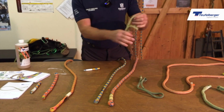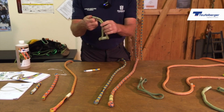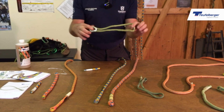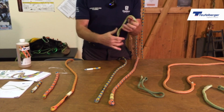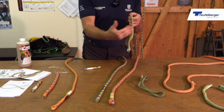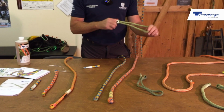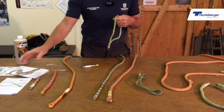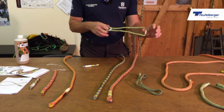We've got another rope here, this is an Ocean Dyneema, and again, because of the fibres that are inside, the service life of this little fella is 2 years before we need to replace it. So not everything is 5 years. Ropes have different ages on them depending on the fibres that are used in their construction. So always check the books. Good information in there, and it will tell you the service life, maintenance, and all the other information that you need to have.